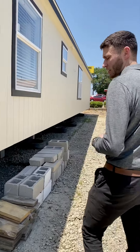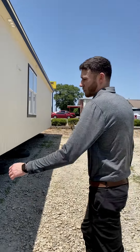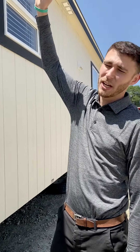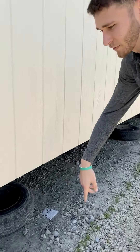Another thing I want to talk about is on top of that frame we use two-by-eight floor joists and then a plywood decking on top of that. We use two-by-four bottom plates and two-by-four top plates. The top plates connect the roof to the exterior wall, and the bottom plates connect the exterior wall to the floor itself.